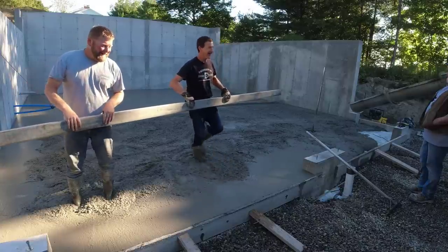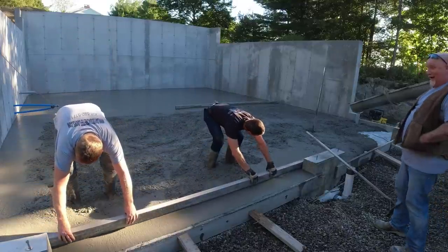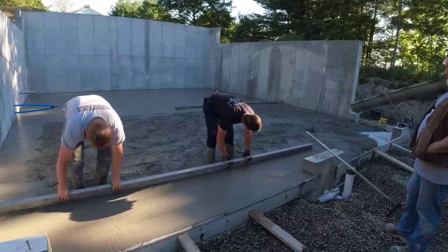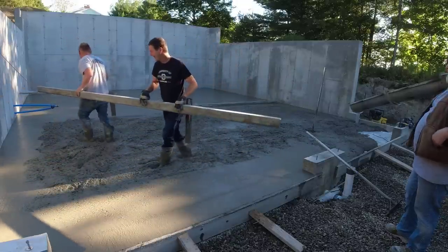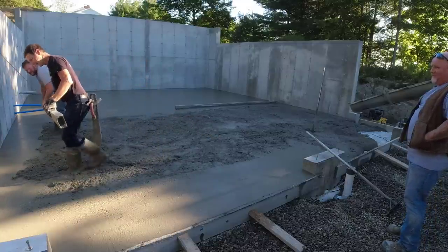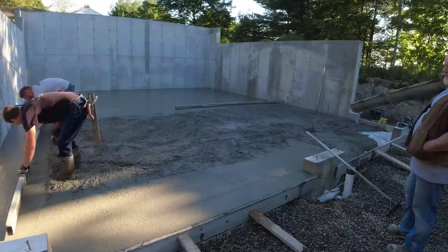Any cracking there is generally a shrinkage crack, not a structural issue. Concrete shrinks the most in the first 24 hours. Darren's going to stay and power trowel it smooth, and then before he leaves he'll saw cut the floor — probably one cut down the middle each way, what we call X-ing the floor. Those saw cuts control any shrinkage cracking. We're checking the garage door form making sure there's no little hump or dip in the wood — we call this striking the door.